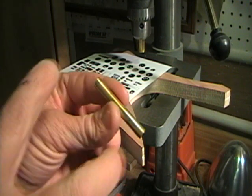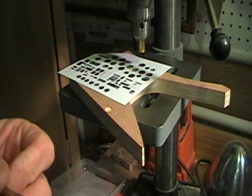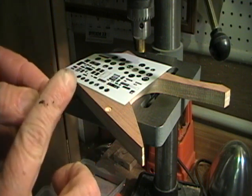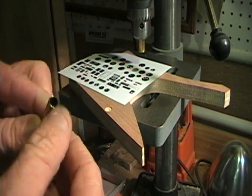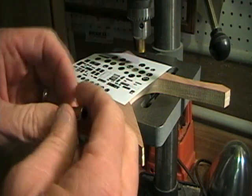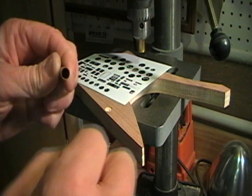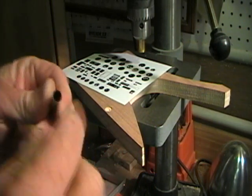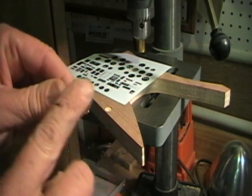Take your brass — I cut it about two to two and a half inches long, whatever fits in your drill press. I used to do it by hand with a drill and it's kind of hard. There are two ways to sharpen it: you can sharpen from the outside — put it in the drill, take a piece of sandpaper, and sand it until it's nice and sharp. Or you can sharpen from the inside — put it in the drill, take an exacto knife, and as it's spinning just lay it in there and it'll cut it out. Then take sandpaper on the inside to sharpen it up, and touch the outside just a little bit to make it really nice and sharp.